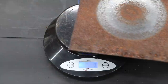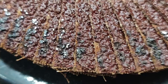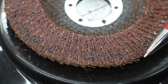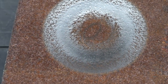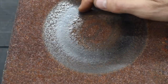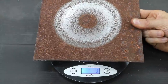The metal used on the Warrior wheel started off at 1000 grams and is down to 996, so it only lost 4 grams this time. It's very hard to see all the sandpaper that's torn away from the flap disc because the backing and the sandpaper are the same color, however there is a lot of damage to this wheel. On the second side the sandpaper lost so much grit that it just didn't do a very effective job. There's a very narrow path where it did a good job removing most of the scale, but there's still a lot of rust scale that has not yet been removed.